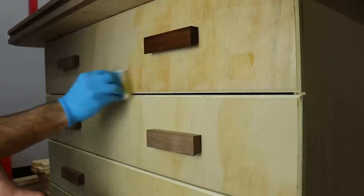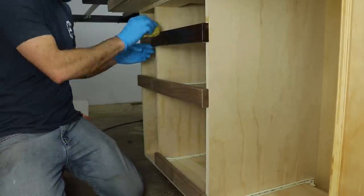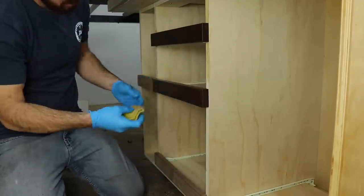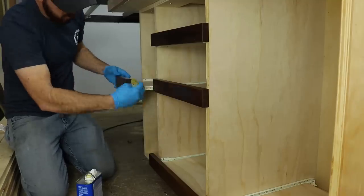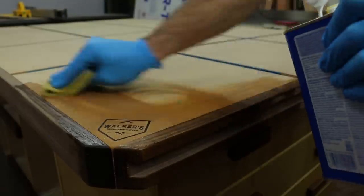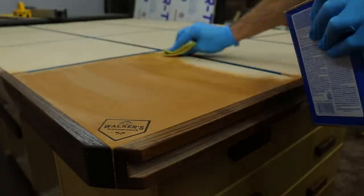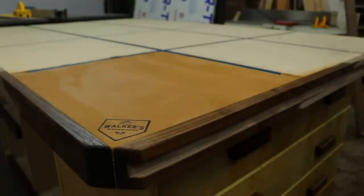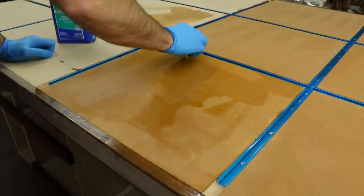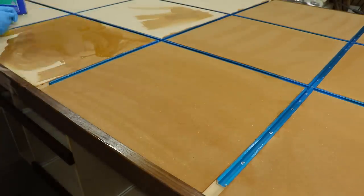The finish I chose was boiled linseed oil — I've actually never used this before but I really like the way it works. It's easy to apply: you just wipe it on, let it sit, and then wipe off the excess, and it leaves a nice natural-looking, not very glossy finish. This came from a few recommendations from people on what they use on their workbenches. However, with the top being MDF, I don't know that I'd choose this again because MDF soaks it up really bad. I think maybe next time I'll try poly — and I've heard you can put polyurethane over boiled linseed oil, so I may actually do that in the near future.